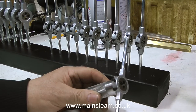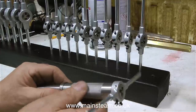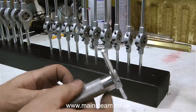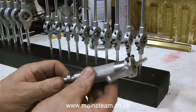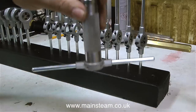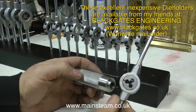I'm hoping you'll be able to see the principle of operation. The commercial die holder presses onto the end of my part, which in turn fits on the existing die holder shaft. And here we have a tailstock die holder of sorts. The technique for using this will be different to a normal die holder, because I will have to hold onto the part that I've made and simultaneously rotate it as I turn the die stock with the long handles to cut the thread on the part in the chuck. If you decide to copy this idea, there's no problem with that at all — it's a good exercise in plain turning, knurling and boring. I'm not going to get rid of my tailstock die holders, and I do have more dies in small drawers in a cabinet on the top of the lathe. But threading with this system is certainly quicker — no more looking for allen keys. I just put a pre-loaded die holder on the end of the adapter, the adapter fits on the shaft in the tailstock, and off we go.